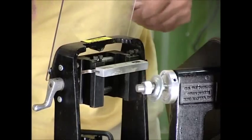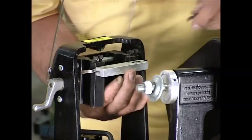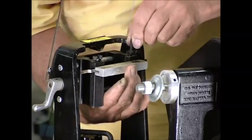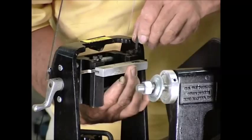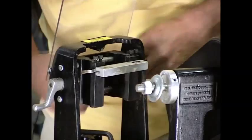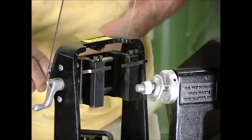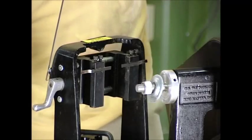Now you see the importance of being able to get in there and clean those slots. While I'm holding that, I'm going in with the Allen wrench and tightening one up on this side, then the opposite side, tightening one up — going back and forth — just making sure there's no stress put on the blades which would cause them to come out of shape. We simply take the magnetic jig off and we're done, ready to go back into production. Sharpening and mounting your blades is very simple — don't make it too complicated. It's really a pretty simple thing to do.